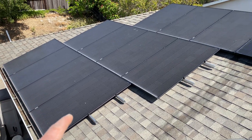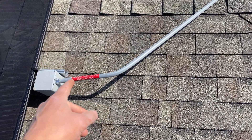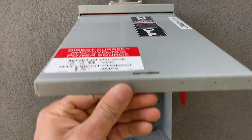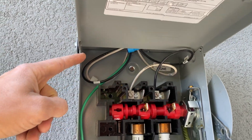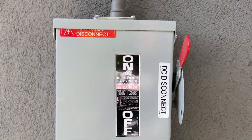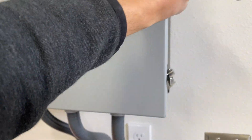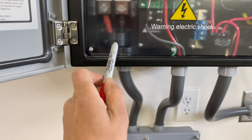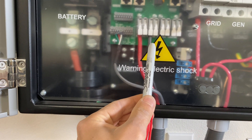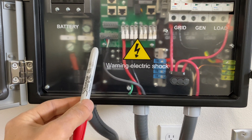For connections, starting from the roof: six panels are connected in series, creating two arrays of six panels running down. In the conduit box on the roof there are four wires — two positive, two negative — going down. Those wires run into a disconnect box where the two arrays are joined, then continue to the inverter. In the garage the inverter has three conduits entering it: the left conduit carries battery wires, the middle conduit carries the solar panel wires from the outside disconnect box.